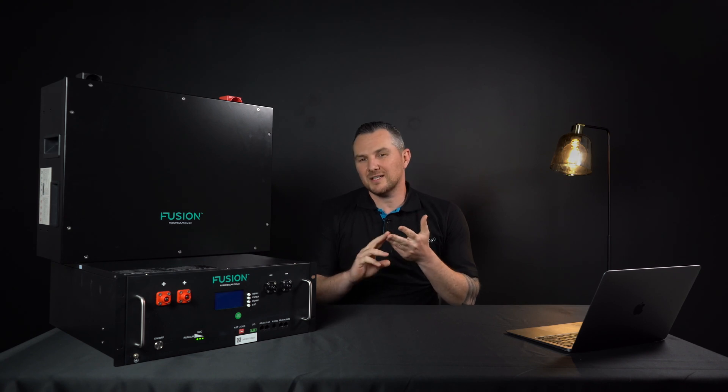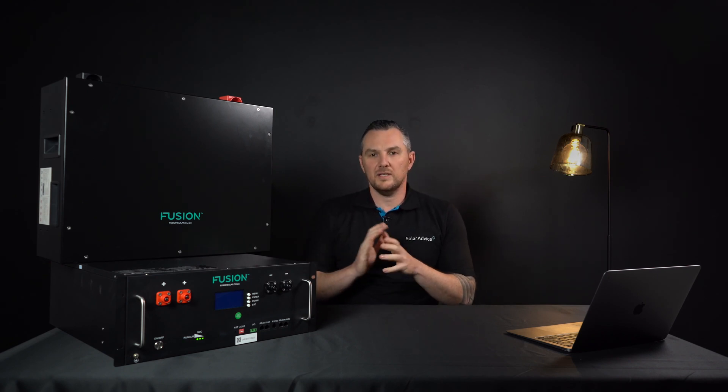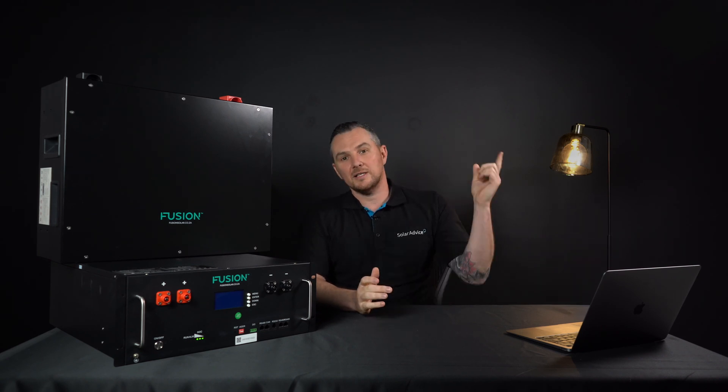Just make sure that whoever you're buying your product from, the two can communicate. You can ask the manufacturer, but your supplier should have this information. The market is changing rapidly and battery sizes are getting bigger and cheaper. At the time of making this video, the typical sizes available are 2.4, 3.5, 4.8 kilowatt hour — like this one — and you do get bigger sizes coming into the market like 5 and 6 kilowatt. Larger battery banks are either made up of the smaller ones connected together or they're completely custom. The most common options on the market are either rack mounted or wall mounted.